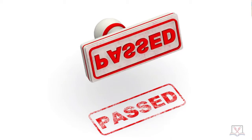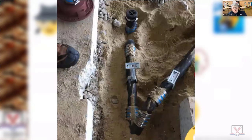There is nothing wrong with this. If you can't guarantee you are on virgin soil with solid bearing between your piping along its entire length, you should be putting hangers when you're using no-hub. Service weight and extra heavy — not so much. No-hub — yes.